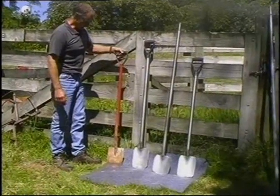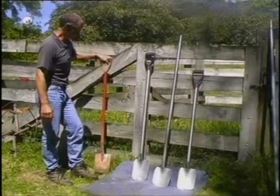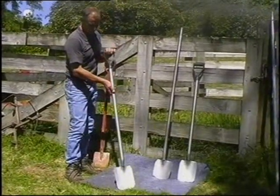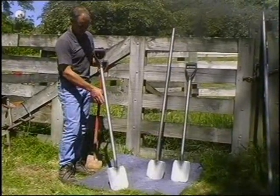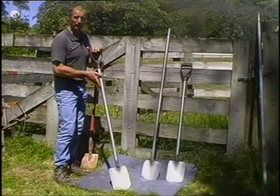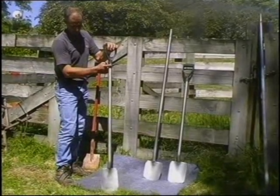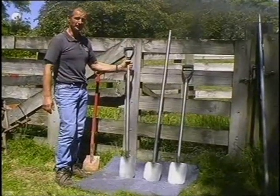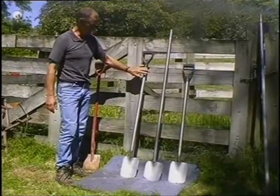This is your nearest equivalent, which is a strain-like spade. This spade is what we call a general purpose fencing spade, mainly designed for people fencing manually by hand. It's long so that you can get to the bottom of a four-foot strainer hole or angle hole with ease. Generally a good spade for people fencing entirely by hand, in medium to hard ground.